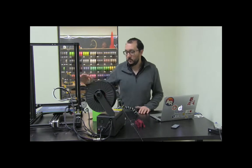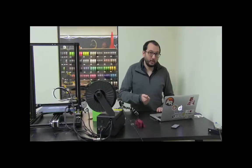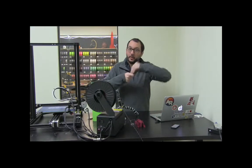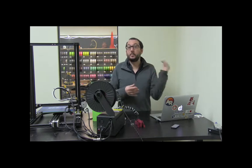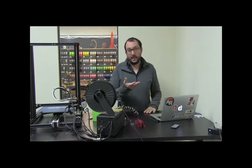The last two troubleshooting steps have to do with the printer — making sure the filament is fully loaded and everything is flowing through correctly. You have to make sure it's heated up to push the filament through. The Preheat Soft Pull feature heats up to 100 degrees and then you pull the filament out at that temperature. It's like changing the oil in a car — it keeps maintenance running smoothly because pulling it out at a semi-solid state removes all the filament in the nozzle and helps keep it clear and clean, cutting way down on clogs every time you swap filament.